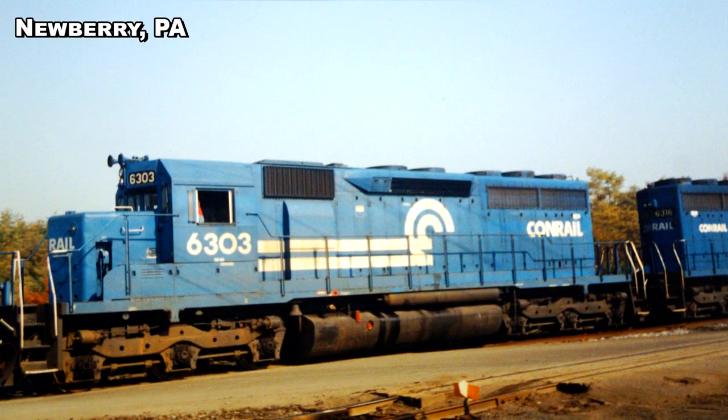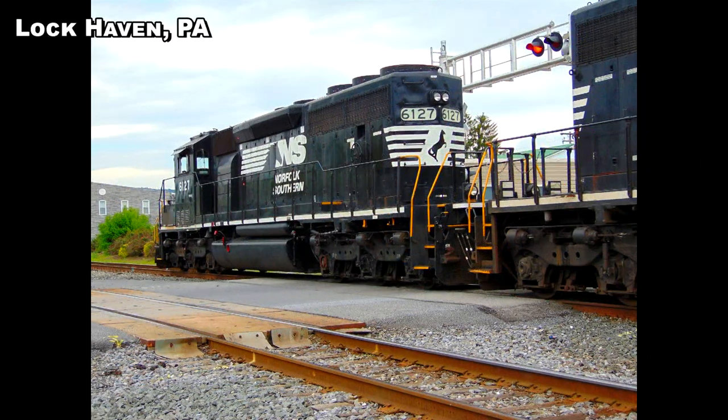The longer underframe allowed for a significantly longer fuel tank with a standard fuel capacity of 4,000 gallons, although smaller tanks were sometimes used. The walkway side frame was 5 inches tall above the air reservoirs compared to 3 inches on the SD35, and air piping was relocated inboard of the air reservoirs as on the last SD35 orders for the Southern Railway.